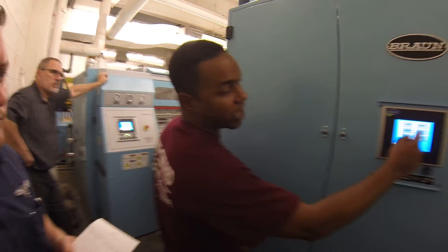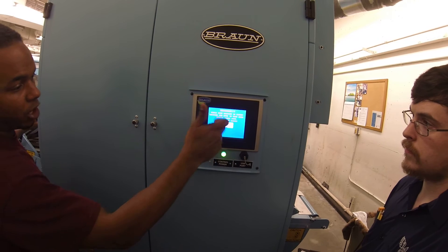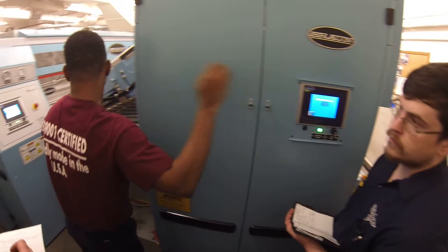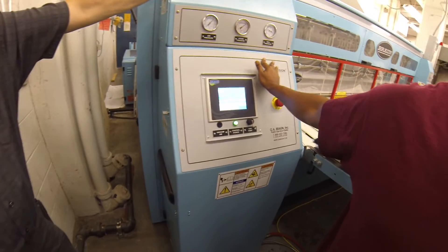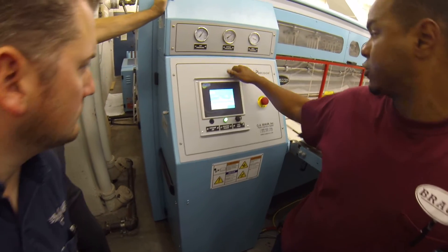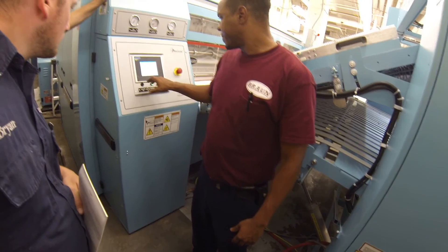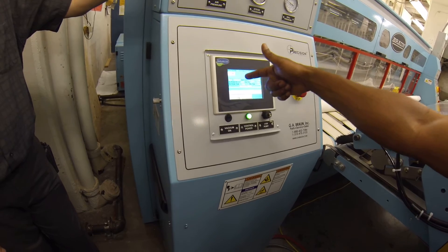When you go to your test mode, you want to go to Maintenance. It will advise that everybody is clear because the chain is going to be in motion. I stopped there because something happened — that machine depends on this one. Now it says 'remote speed reference' because this one stopped, and this one automatically will stop. So basically when you're going to replace your rolls, you want to stop this one first. Of course you want to do it with the machine stopped. You have your roll — you want to go up, hit Acknowledge. Now if I start the machine again it will give me the alarm because this one is not running.